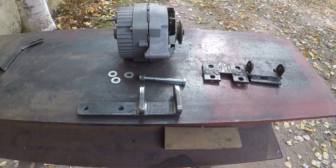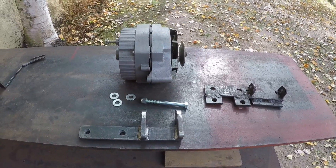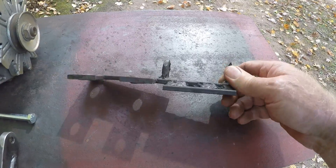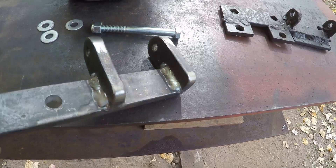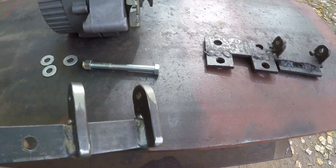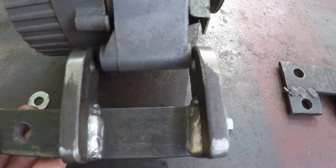Back on this M project here, I'm just getting finished up on a new alternator mount. This tractor has been converted to 12 volt - they took the 6-volt generator out before I got it, and a 12-volt alternator was put in with a really funky bracket. Pretty shabby looking - maybe in the art world they'd call it art, but in my world I call it scrap. So what I did, I kind of took patterns and stuff and made this new bracket for it right here. As you can see, it's all drilled and I've pre-fitted it on the tractor already. It seems to fit pretty good. I just notched some notches out of the pieces so I can get a good weld all the way around on it, and I also gave a little extra for about the thickness of three washers for the final adjustment for belt alignment.